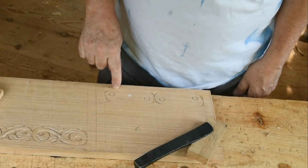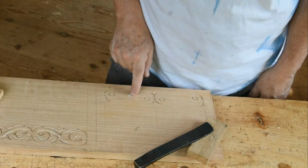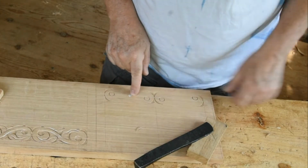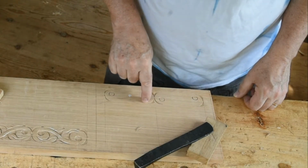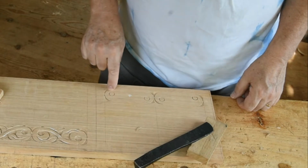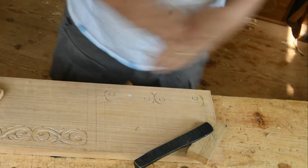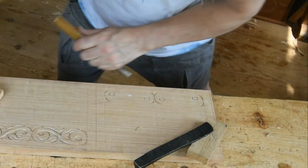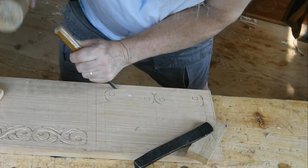I'm going to come from this margin, curving up outside that center point to my left of it, and then I'm not going up to the other margin. I'm going to connect to that circle, and then the one from this margin comes outside to my right of that center, connects to the circle. So margin to circle, circle to margin. It's easy to get those crossed, and you'll do it if you carve enough of these. I still do it sometimes. That's why it's nice to have that center point.